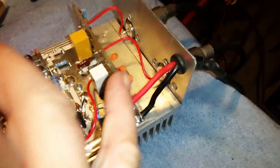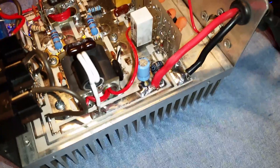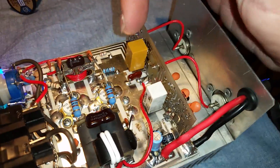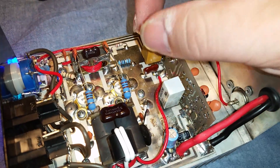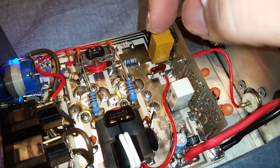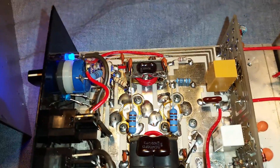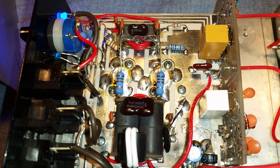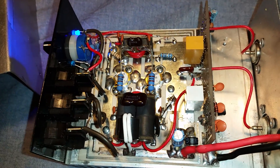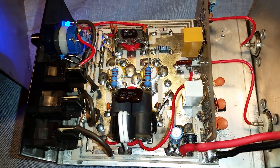There's a few things I had to do to the preamp. I done that quite a while ago — I can't remember exactly what I did, but the preamp works now. The last thing I couldn't figure out, but I finally did, is that the relay was bad. Two of the contacts weren't touching when it actuated on the antenna side. So I went ahead and threw in a brand spanking new relay. This thing is nice and clean, and if you ask me, it's better than it was before it was hooked up backwards.